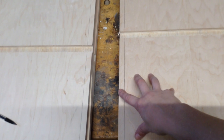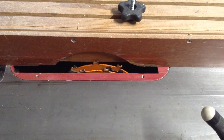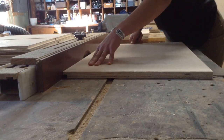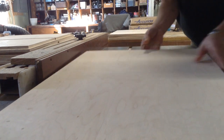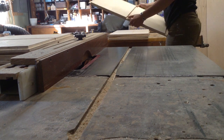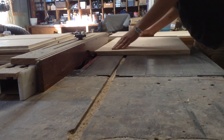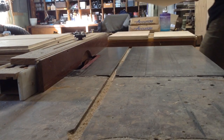At this point I split my stack into four and four and I put the rabbet on the back for my plywood backer. I'm using a half-inch backer for this. I use half-inch backers for all this stuff because I have to transport them — there's a lot of torsion applied moving them to and from the space, so I like a more substantial backer. Some people could probably get away with a quarter-inch backer, but honestly quarter-inch and half-inch plywood are about the same price these days, so going a little bit thicker won't hurt anyone.